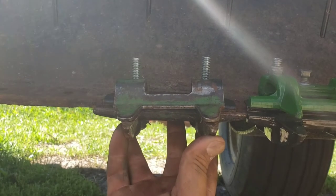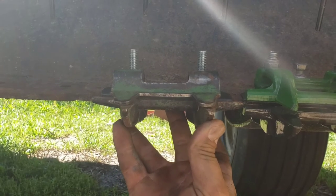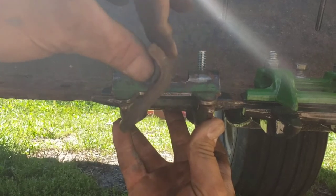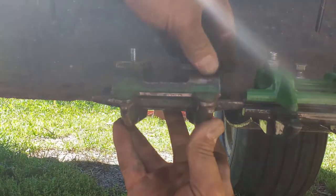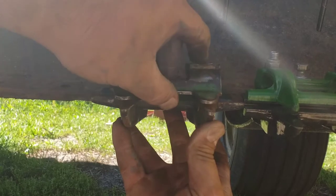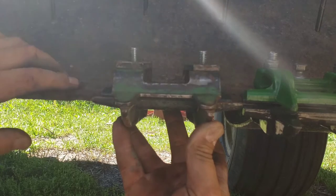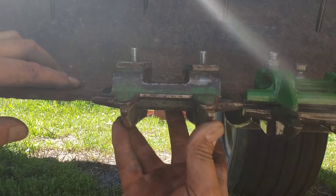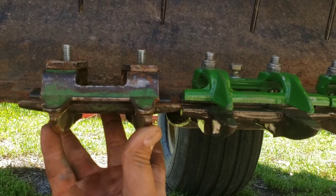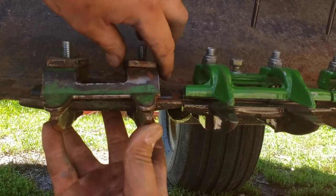You've got this thin little clip, and it's a three-piece deal. You got these guys that go on here like this, and then as you tighten down these nuts, it pushes down pressure on this tab and holds your clip down against the sections in the cutter bar. But I don't like this design. I've got all new one-piece. These are heavier-duty, and it's a lot easier to adjust. A lot nicer than this, so I'm not going to use this.